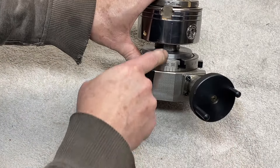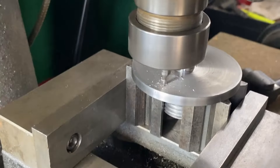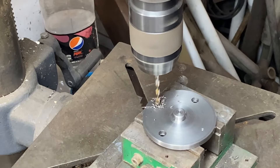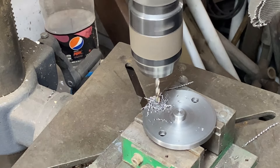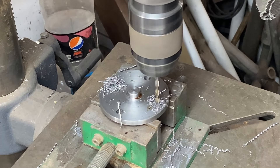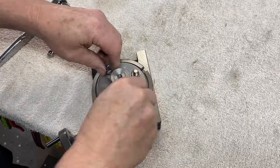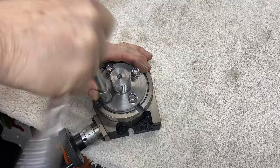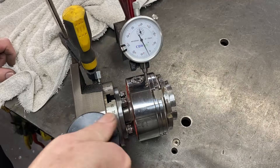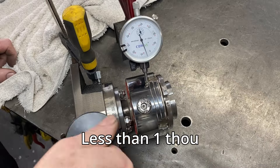The next step is to drill some holes in here for the T-bolts. I've marked these holes in the mill using the DRO because I can't drill right through the part the way it's set up. I take it out of the mill and over on the drill press I finish off those holes. They get bolted on there like that, and then the chuck screws on. Out of curiosity I put a dial gauge on and it's moving about two hundredths of a millimeter, so I'm pretty happy with that.